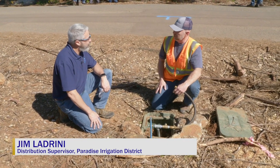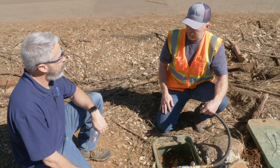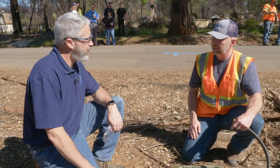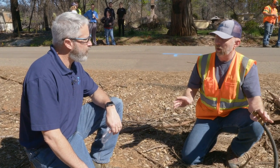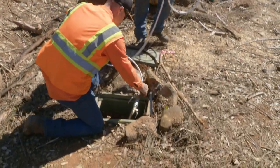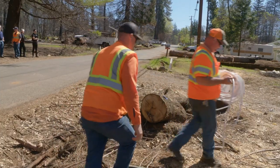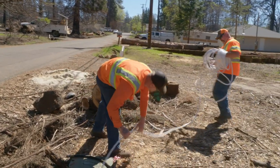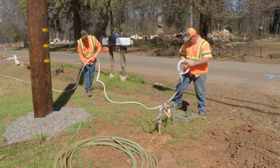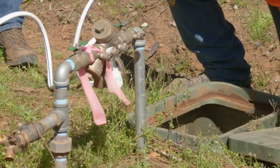So that's good news. Now we are looking at having to sample a standing structure. In order to sample the standing structure, we need to isolate it. In order to isolate it for the stagnation period, we need to provide them with water, because we do not want customers to be without water at any time. So we will utilize this service line — now that it's come back non-detect — as the supply line for the standing structure. We'll utilize a hose going from this apparatus to the customer side service line on the standing structure, give them water, and set up this same apparatus on their service line to sample them in the same manner.